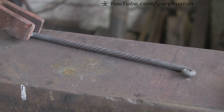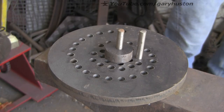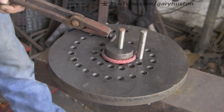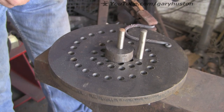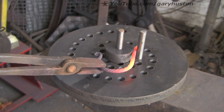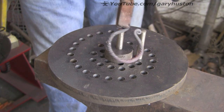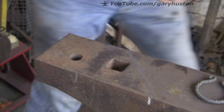Next job — good old bending jig again. You can muck about doing this over the anvil, but if you want to try and make some money, you want to knock these out as quick as you can. So this little bending jig is just perfect for the job. Let's turn it round and heat the other side. I put the wrong end in — I should have put the original end in and then pulled the short end round. But it still worked, just a bit of an arse-about-face way of doing it. You still get the results — a nice, uniform, round bit of kit.